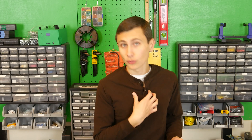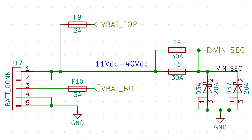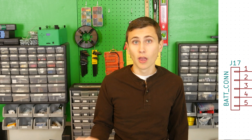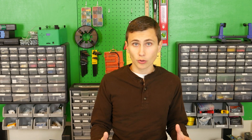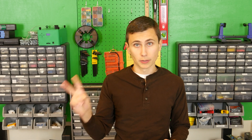Introducing one of the simplest, and my personal favorite, reverse polarity protection methods: a fuse diode. I grabbed a couple of beefy diodes, each rated for a peak current of 100 amps, and put two of them in parallel. We can reasonably expect these two to survive a transient overcurrent condition on the order of 100 to 170 amps together. This current, in combination with two parallel 30 amp fuses, should blow with plenty of margin in just a few milliseconds. By shunting all of the reverse energy through our fuses, we take the fireworks show that would be the whole board exploding and condense that destruction into an easily replaceable fuse. These fuses have a resistance of about 2 milliohms, and the diodes barely leak any current, dissipating about 55 milliwatts across the two parallel fuses. That's a pretty sweet compromise — we achieve the efficiency we crave but also provide reverse polarity protection for the system.